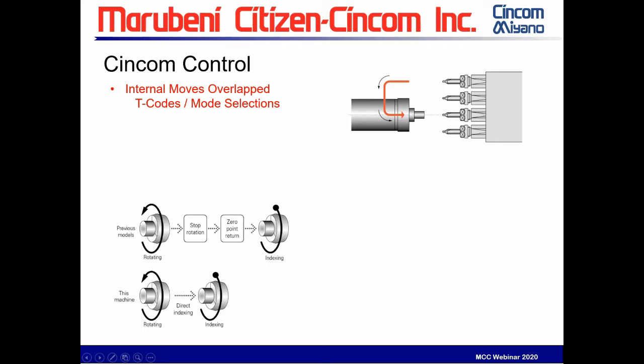Another function is the direct command spindle C-axis. You don't have to stop your spindle and orient to zero to find your indexing, so you just stop it at whatever angle. You can be running at 4,000 RPMs and need to make a cut at 45 degrees to a feature. You just index it to 45 degrees, and the machine stops automatically. Saves you a little bit of time.